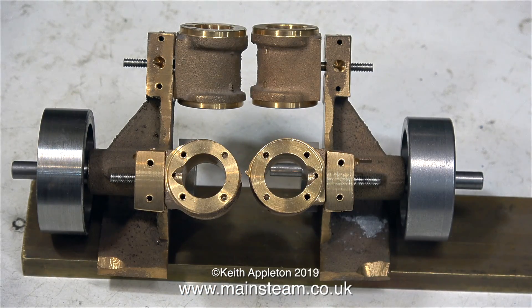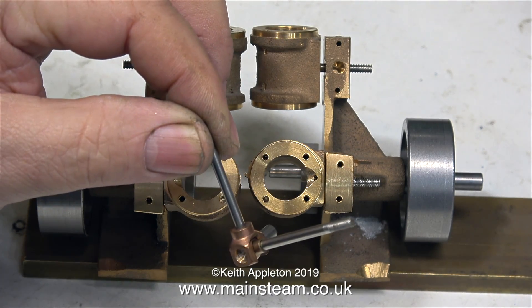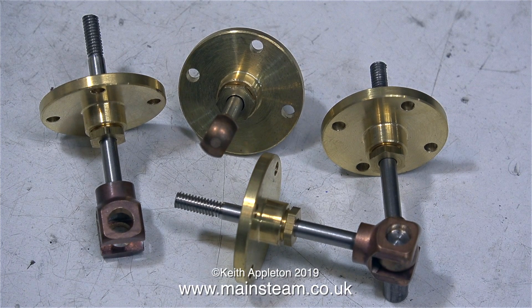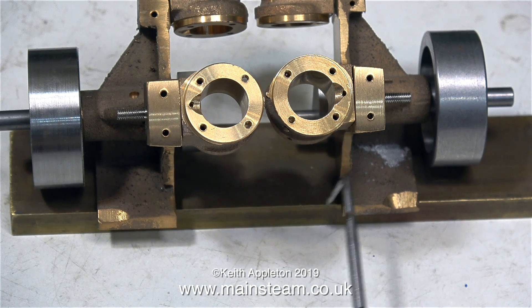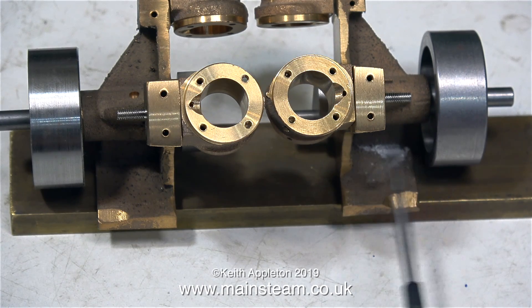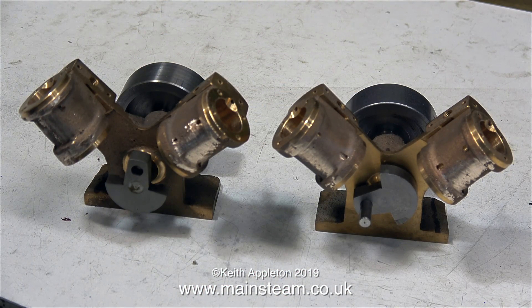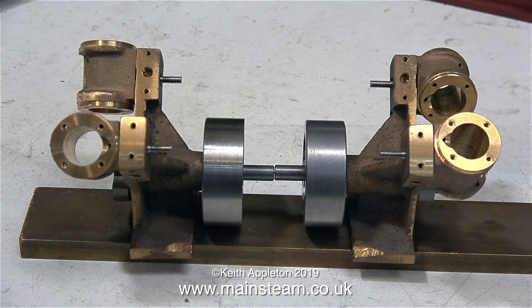So here's my proposed layout: the cylinders will be back-to-back and will all oscillate very merrily in the middle of the engine. This arrangement may even reduce some of the vibration from the reciprocating masses. Here's the arrangement of the piston rods and big ends, temporarily fitted to the original crank pin which I'm not going to use, and here's the complete assembly fitted into the four lower cylinder covers. I'm using my scriber followed by a felt-tip pen to illustrate that I'm going to cut off the ends of both standards, but I won't be doing this for a while yet. I'm showing this clip out of sequence — as you can see, I've been doing a bit of fettling of the castings, and I'll show this in detail in the next episode.